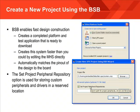Right. Now, after you've answered all the questions, your MHS file will be made for you. You may not recall this, but the MHS is your entire hardware design in a single text file. This is what is changed by EDK when you modify your hardware design. All of your peripherals and their chosen options are also stored in this single text file. I mention this because the MHS is user editable, although it is not necessarily recommended for that use. But I still encourage you to crack the file open and have a look. The syntax is pretty simple.